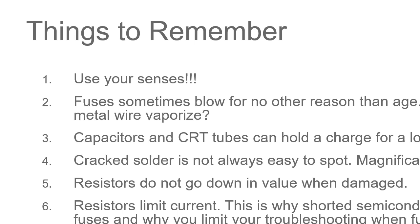You might find a resistor getting red hot. You might even see it smoking a bit. So look down circuit from it to see what is drawing all that current that's causing it to get hot like that.